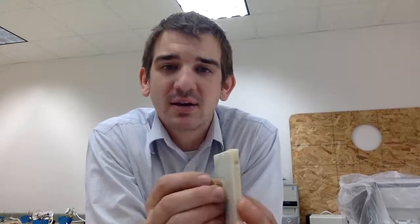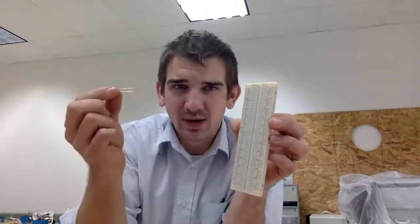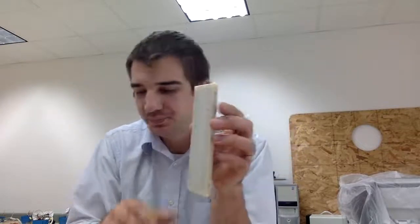All right, so when it comes to your breadboard, they're brand new, which is a wonderful thing, but sometimes, like it says on this piece of paper, the fittings, the socket holes, can be a little tight. So if you have a small paper clip and you're struggling to get little resistors or LED leads in, you can just press the paper clip in and it'll loosen them up just enough to work. You're not going to need to do that to every single thing on here, but if you're struggling to get something in, a tiny paper clip will go a long way.